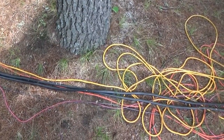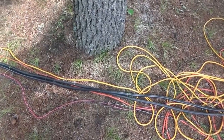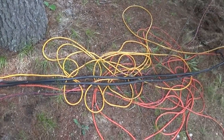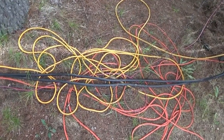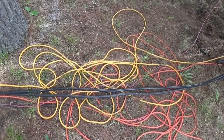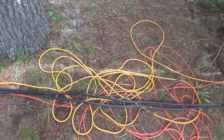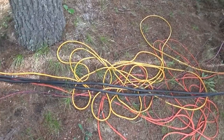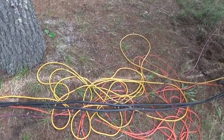The two black camper wires are not hooked up - they're just too short to reach from here to the house. The 100-foot AC extension cords running DC through them is very, very wasteful - too much loss in the lines. They're 14 gauge wires and it's just terrible. I've had a very inefficient system. I want to run cryptocurrency mining rigs for free off solar power, but they've been shut off since February entirely because I can't afford to run them.